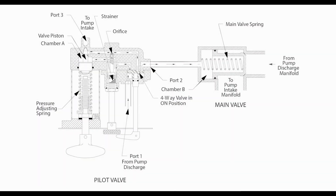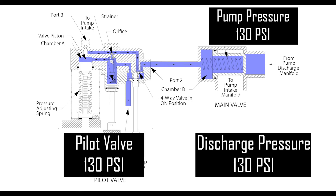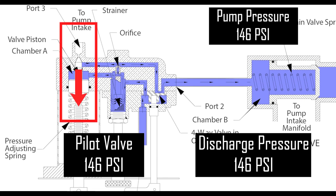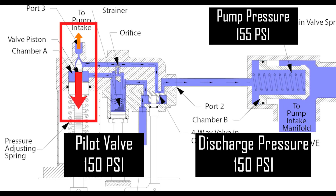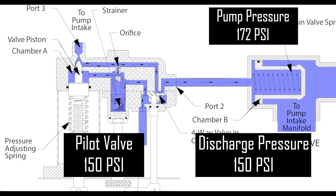To summarize: with the pilot valve on, water enters both the pilot valve and the main pressure relief valve simultaneously at the same pressure. As the pressure exceeds the pressure set by the T-handle on the needle valve, the needle valve will open, reducing the pressure inside the pilot valve which maintains the set pressure on the back side of the pressure relief valve.